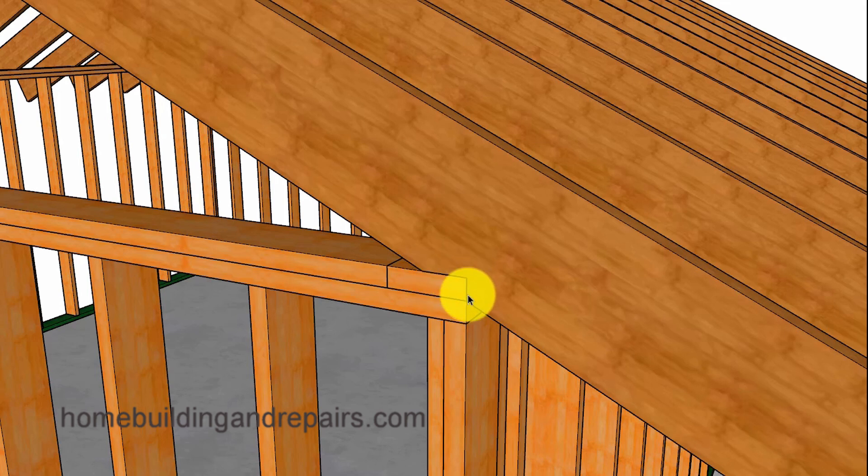However, the length of this measurement here could affect any type of materials you're going to be finishing the building with and whether or not you need to install your shear panel on the exterior before you install the roof rafters. And the reason why I didn't focus on this in one of my popular videos about cutting a roof rafter is because there are no standard engineering details for this.